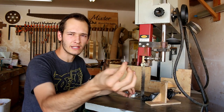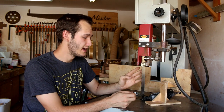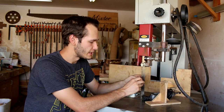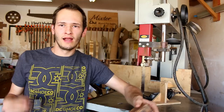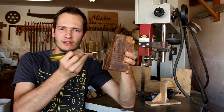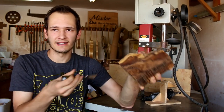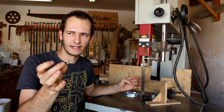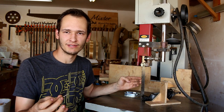At that point it's not really cutting into the wood and taking material away — it's more scraping, which makes for a duller blade, more burning, heats up the blade — lots of bad news. So now I have to reshape the gullet, the inside of the tooth. I have what I believe is an eighth-inch diamond honing bit. I'm going to take the blade off and reshape each one of these teeth by hand. Instead of that scraping motion — like this chisel just scraping flat against the wood — if you go at an angle it digs in, and that's exactly what needs to happen with the bandsaw blade.